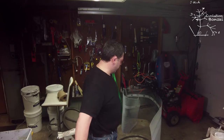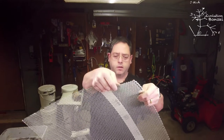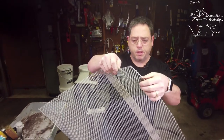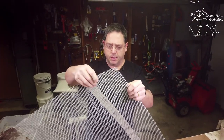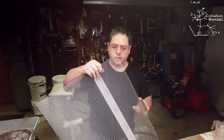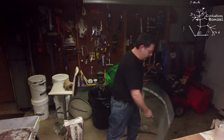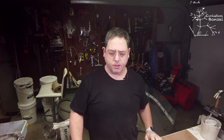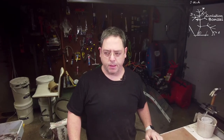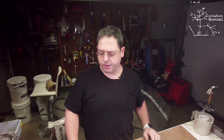I also reinforce the fibers, and for that I use this sort of material, which has a thickness to it, maybe 2 or 3 millimeters thick, and once it's fully embedded as the form, I then put cement all around it, very thin. It can be very thin, so you will see how thin and light the product will be. And with that, it will be further strengthened.